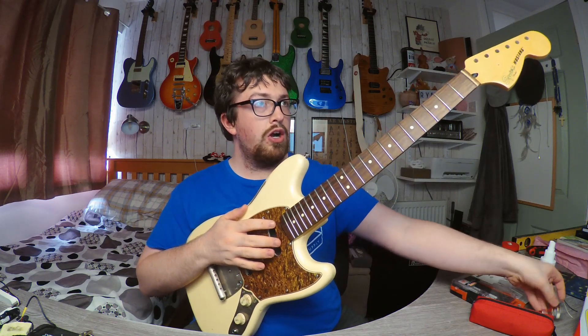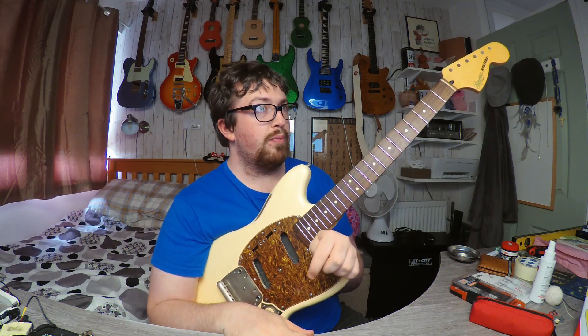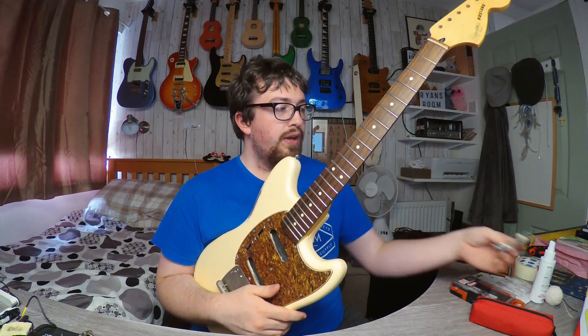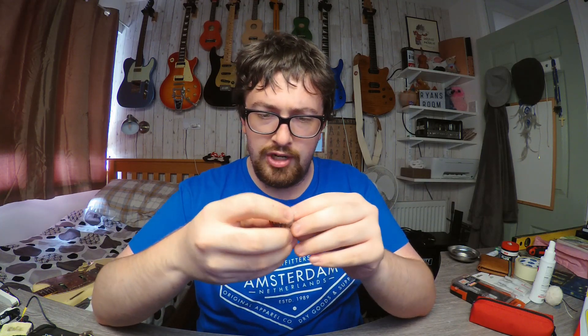As you can see, the ones I have coming are white ones, which are on-on switches — like your Jazzmaster, straight down and straight up toggle switches. I bought them by mistake because I thought they were on-off-on switches. So last night I bought a set of on-off-on switches from All Parts, which are black ones. I want to see how the white or the black look in it. These are Switchcraft — the original ones — but whoever owned this before me decided to clean them in a way that wasn't the best, and they started to corrode in some areas. I'm generally thinking of not using these, because if there's corrosion on the outside it leads me to believe there's corrosion on the inside as well. But we'll see — the switches worked fine.